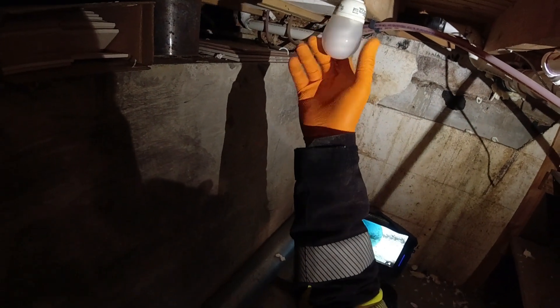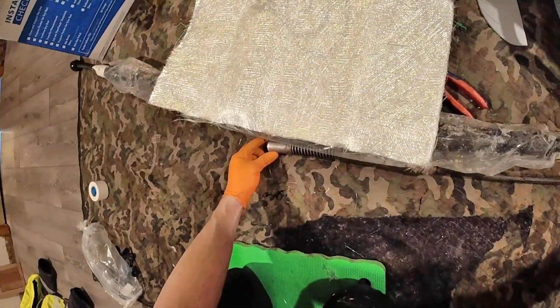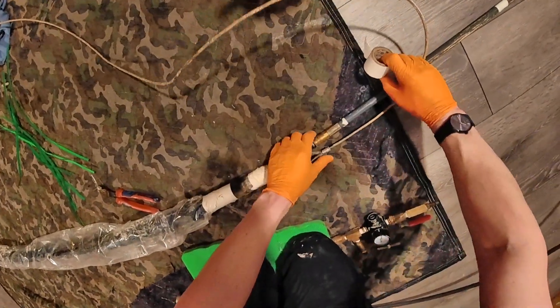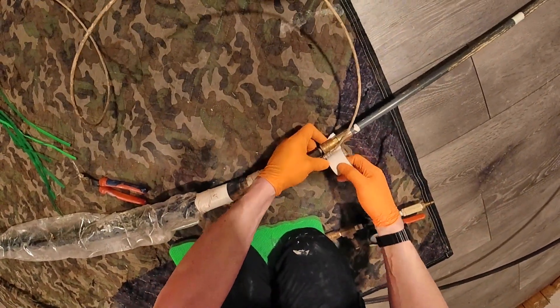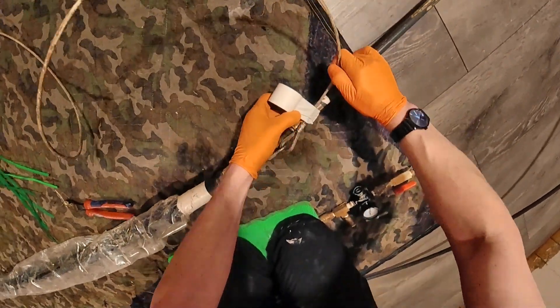Here I am in the process of getting everything measured out, so I know exactly how far the packer goes in to put the liner patch in place. Then I get distracted by this light bulb that's not working — I see this humidistat. I decided to toy around with that, and for some reason they got this light bulb attached to the humidistat. When it gets too humid, maybe they had a heat lamp in there to help dry it out. Anyways, we got light, we got the liner patch, we got our air, we got our tape, we got our pullback cable, we got our flexible coupling between the pushrods and the packers — we got everything ready to go.